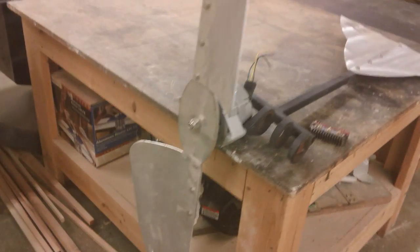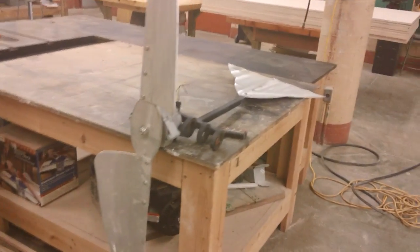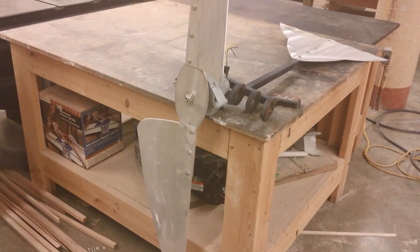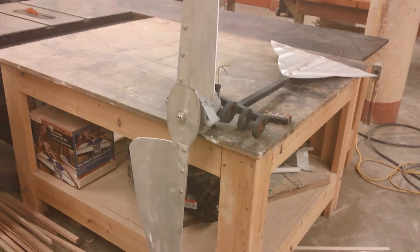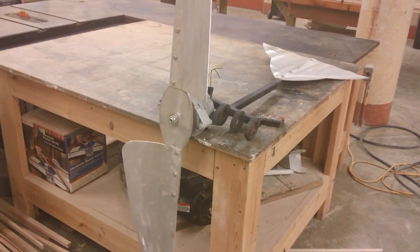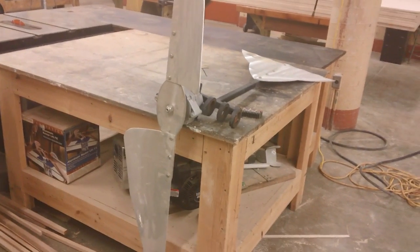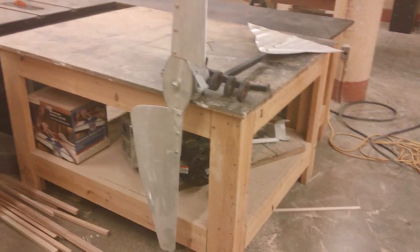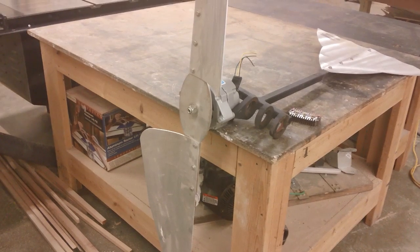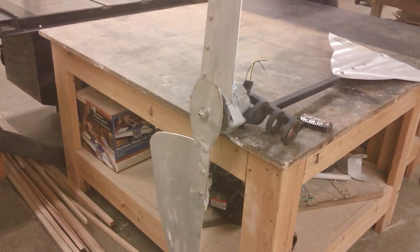Along with the bracket, this blade kit comes with it and the tail — it bolts on there. You might think that's not much blade, but really the ones that have more blades have less speed and more torque, and are designed for pumping water, where two blades like this can actually be faster than the wind and produce more electrical power than the multi-blade ones.